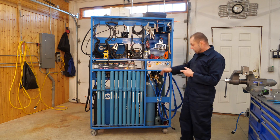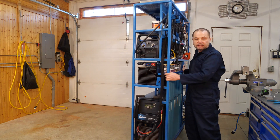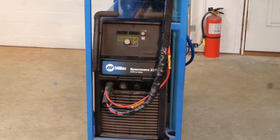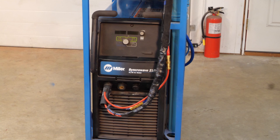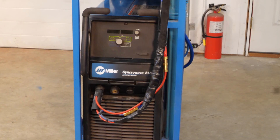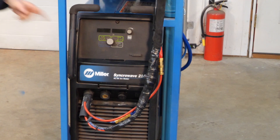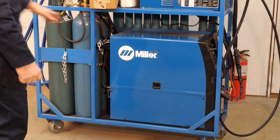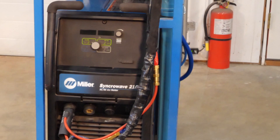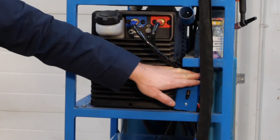This is the back of the electrical panel and the back of the cylinder rack. On the front close-up, at the bottom is the Miller Syncrowave 210 machine where all the hookups and settings are accessible from the front. Because of how the Syncrowave 210 is designed with its side-opening door, you cannot put anything on top of this machine. So the water cooler, which you'd most want on top, is instead resting on a shelf above, with a dedicated switch for it.